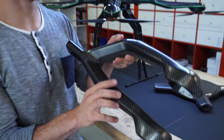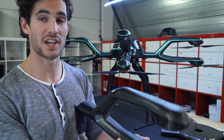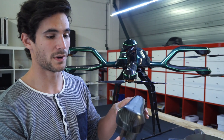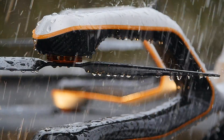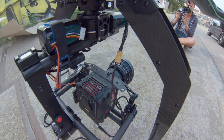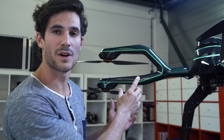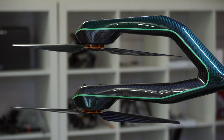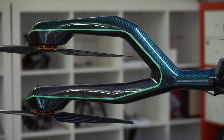As you can see here, this is the carbon fiber boom of the NEO. It supports the brushless motors mounted upside down. Mounting them upside down protects the motors during environmental impacts of a flight, landing, or take-off. The V-shape of the boom cancels out any vibrations — the same technique as a tuning fork — minimizing high frequency vibrations, which are key for a clear image.